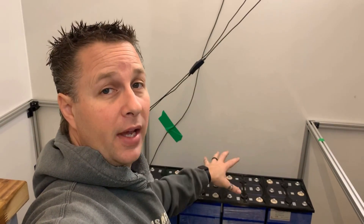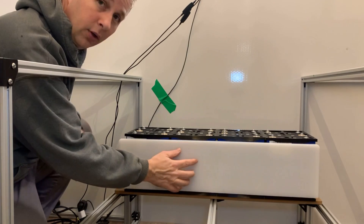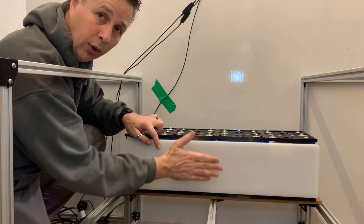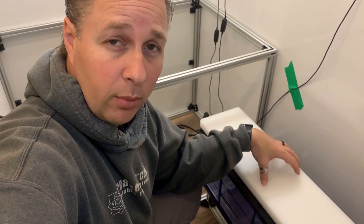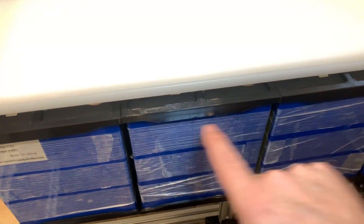Because this battery is quite large and will weigh just shy of 150 pounds when completed, I've taken it back out of the hole it sits in to assemble it. I'll do a dry assembly out here, then disassemble it, put it back in the hole, and reassemble it. With all the cells lined up, you can see where the cutting board piece is going to go, and between each of the cells there will be a pair of threaded rods pulling everything together. Getting the location of these threaded rod holes is pretty important because I don't have any extra space, and the width between rod centers will exactly match the width of the printed trays.